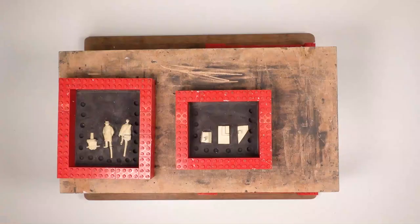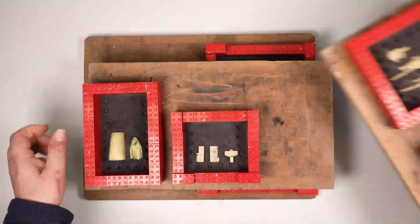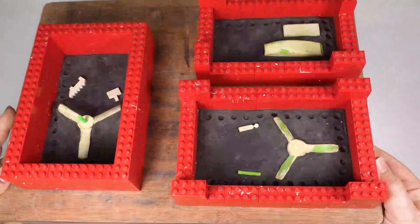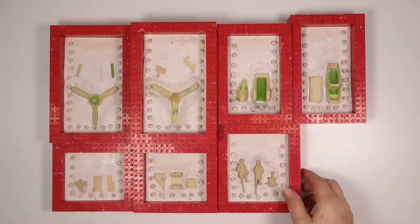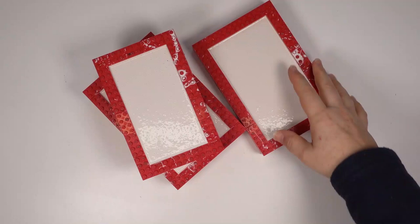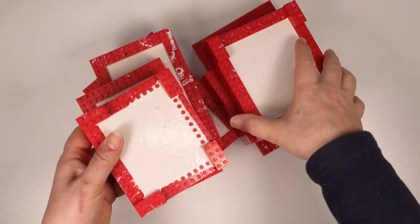To create the metal masters, I make cold cure silicone moulds. I begin by embedding the masters into plasticine and build a Lego box around them. With the first half poured, the moulds are rebuilt without the plasticine, ready to pour the other side. The Lego can now be removed and the moulds broken down, ready for the feeds to be cut.